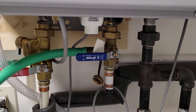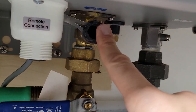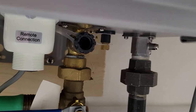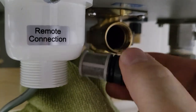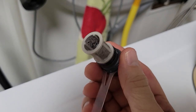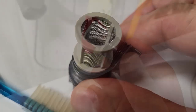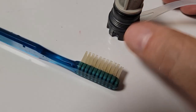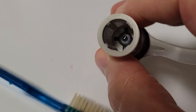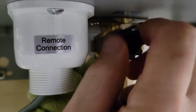Once the hour is up, turn off the pump. Before restoring the valves to the normal position, there's a filter right here — you'll want to open that, take the filter out, and clean it. When removing the filter you may want to put a towel and a container nearby to catch any excess water that might pour out. With the filter out you can see there's probably crud on the inside that needs to be cleaned out before you replace it. Here's what it should look like after cleaning — if you find it difficult to back-flush with water, try a toothbrush and some dishwashing soap to loosen everything and get it out. Once it looks brand new, you're ready to reinstall the filter.